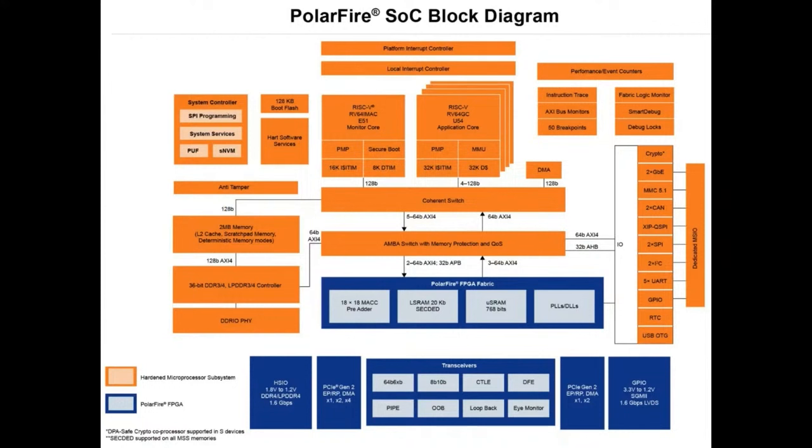There's a lot of details about the PolarFire SOC. I've never worked with one of these processors, but what's interesting is you get the benefit of using the FPGA for hardware interfacing — driving specialty machinery, robotics, motor controllers, LED displays, TFTs — you do that on the FPGA side. But the part you don't have to worry about, the Linux kernel, device drivers, memory management — that's in hardware and taken care of for you, with a very tight connection between the two because they're on the same chip package.